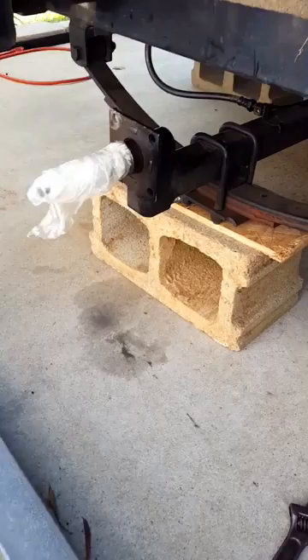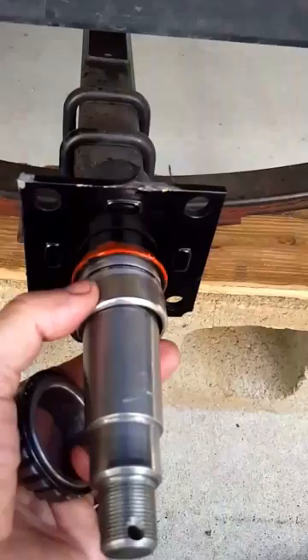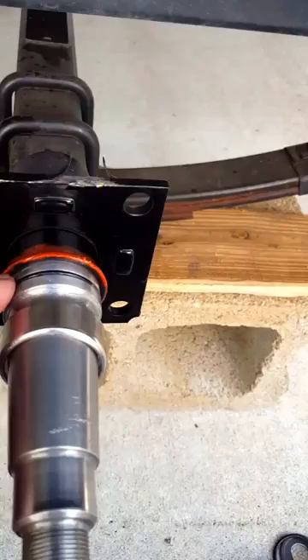It's a DB 35 assembly. I didn't see this on YouTube, so I decided to make this video. Now, the wear sleeve goes on like this — it's driven on to where it goes over this seal right here, and this wear sleeve will butt up against the bigger seal in the back of the spindle.